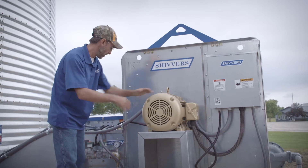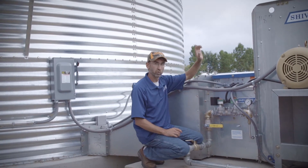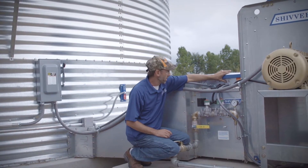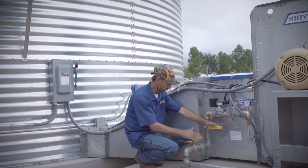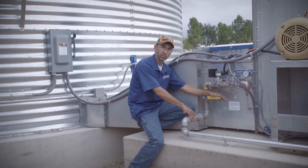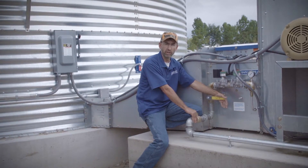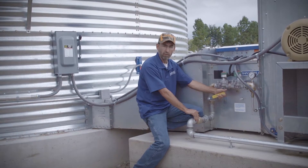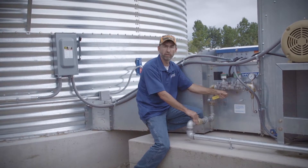Once the fan is up and running, that puts power over to our burner circuit. Our burner circuit basically has one switch on our heater — it's either on or off. So right now, burners should be ready to go. We have two gas valves here. This is our main gas valve shutoff — it's our safety shutoff. This valve here we're actually using as a pressure regulator valve. If we need to get up to 150 degrees and need a little more gas pressure on our gauge to reach that temperature, we adjust this valve accordingly.